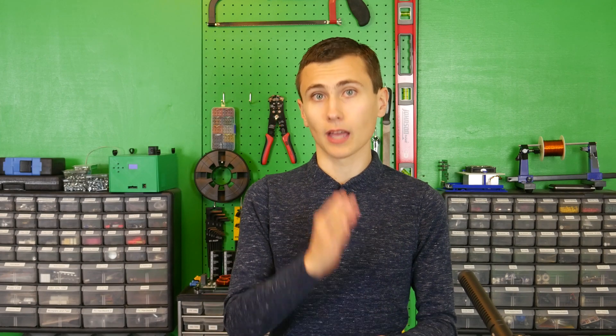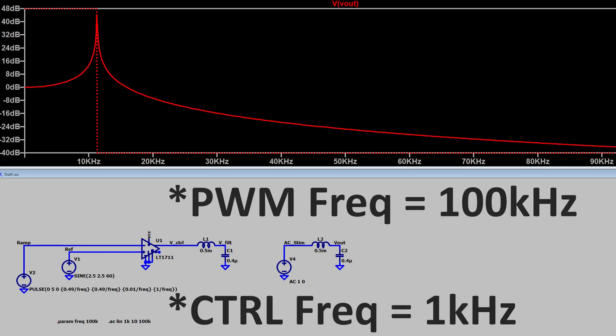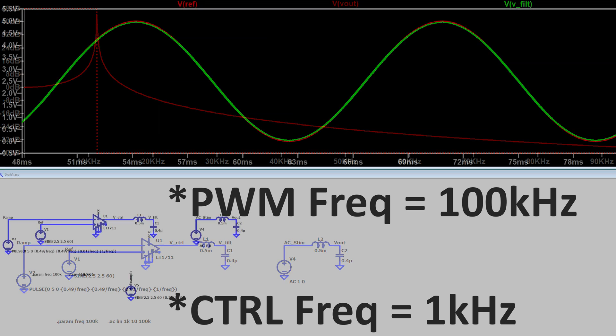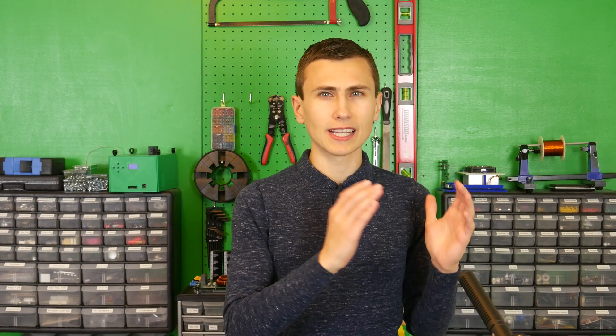The issue is that our inverter is always catching up. While the transistors are chopping up the high voltage DC bus with not much delay, we're actually regulating the amplitude of the sinusoidal output after the LC output filter, which adds phase delay. That delay depends on the actual values of our inductor and capacitor, which have a combined tolerance of around 30%, varying with temperature — making it difficult to know exactly what the phase delay will be at any point in time.